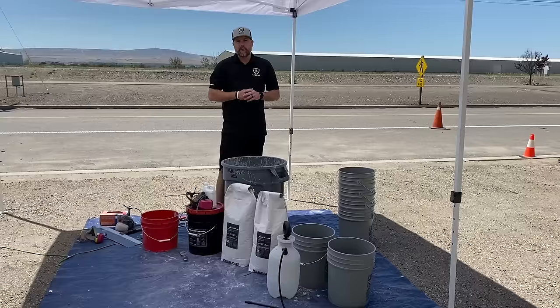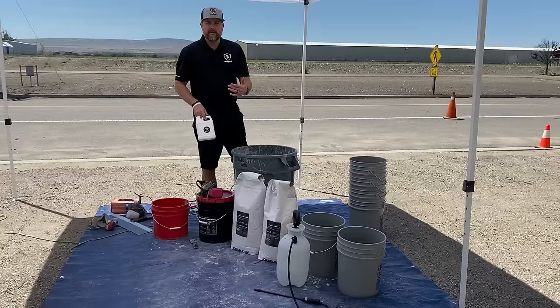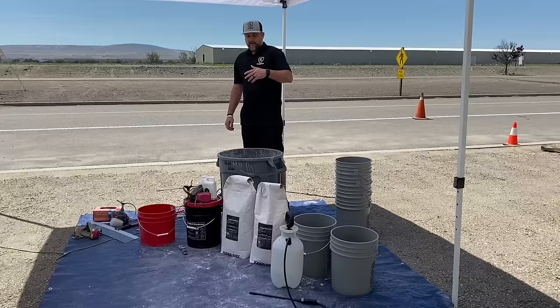And then we have the two bags of our concrete overlay. Two bags goes to one five-gallon bucket. And then we have our liquid modifier — what this is going to do is give us extended working time in hotter temps. So this is basically the product. And then the supplies we'll need for applying it: we're going to need a pump-up sprayer. We're going to be hydrating the asphalt with water, cooling it down, so it's not sucking all the moisture out of the actual cement.